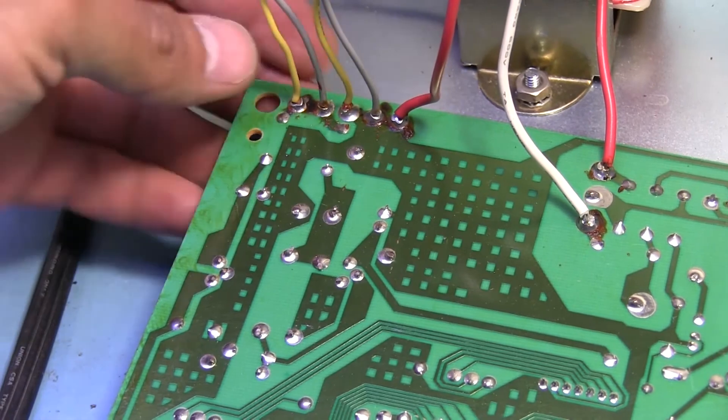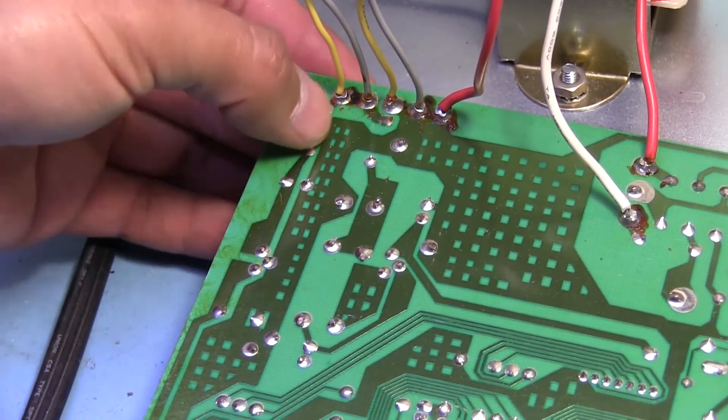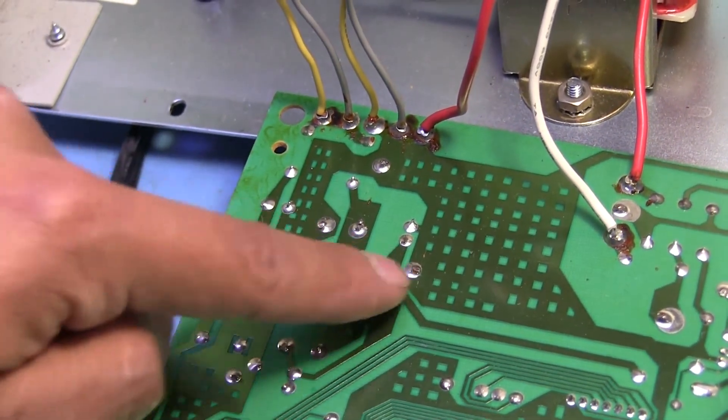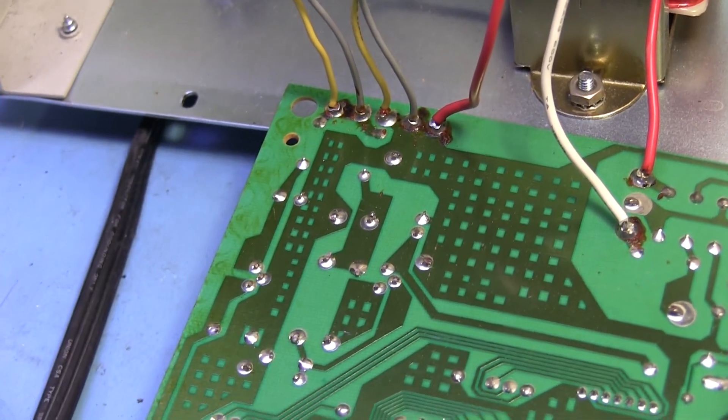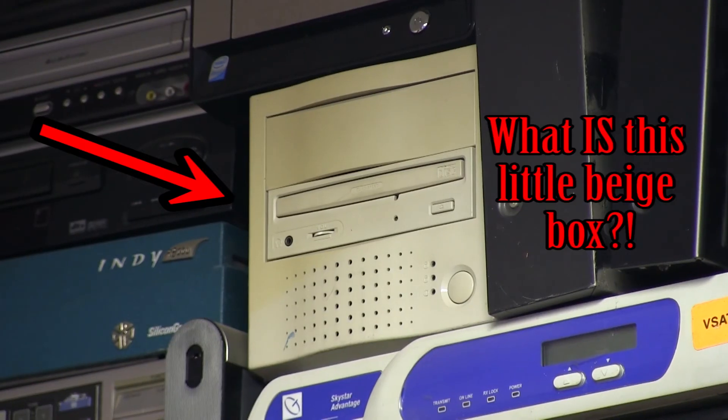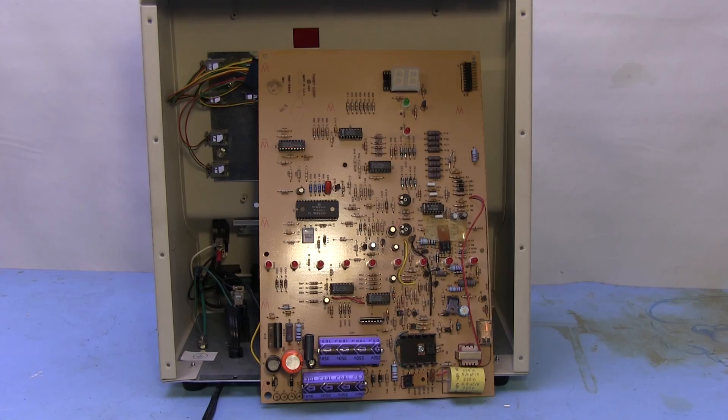All this other stuff right here just looks like low-voltage stuff — it goes through a couple of diodes and then some capacitors, and yeah, these two transistors do look like they're just being used as voltage regulators. Alright, that pretty much concludes a look at the inside of and a demo of this old Radio Shack telephone tester. I hope that was at least somewhat interesting, and I kind of hope you guys stick around because I have something I want to do a demo and teardown on that I think is actually very interesting as well, and it also has something to do with telephone equipment. Thanks for watching — I'll see you guys around the bench.